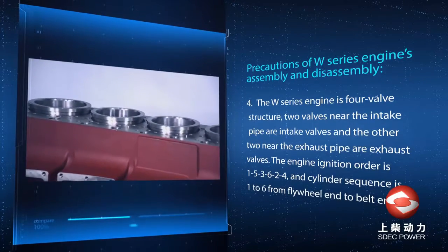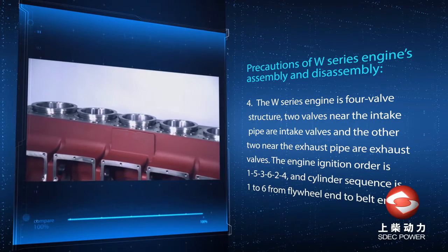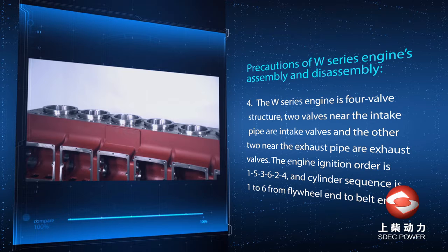4. The W Series engine is a 4-valve structure. The 2 valves near the intake pipe are intake valves, and the other 2 near the exhaust pipe are exhaust valves. The engine ignition order is 1, 5, 3, 6, 2, 4, and cylinders are arranged 1 to 6 from the flywheel end to the belt end.